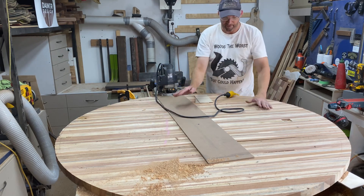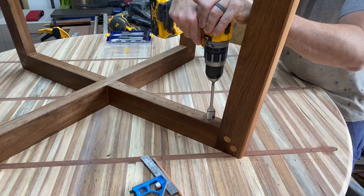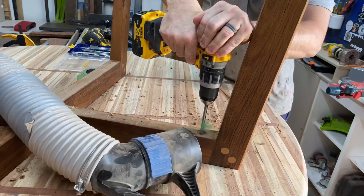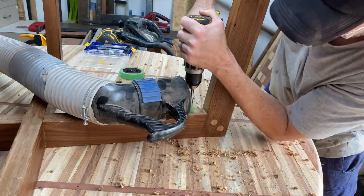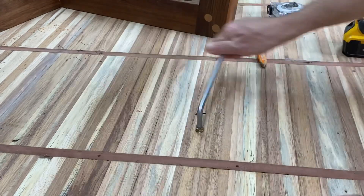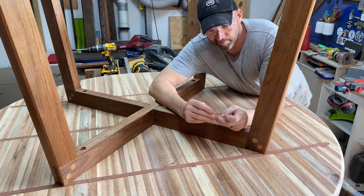Using the router to cut these grooves — don't forget to clean off any little squeeze-out because the router is going to hit it and make life hard. I'm going to slot these pieces of red gum in — could be ironbark, it's nice and hard. It's not actually this piece of timber I'm relying on for strength; it's these tiny little bonds to decrease the bending moment of all these individual slats so they're all bonded in individually. Like plywood, that bond should be nice and strong — makes sense to me.